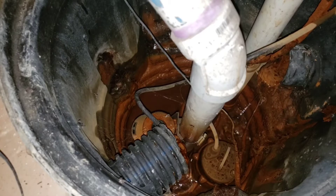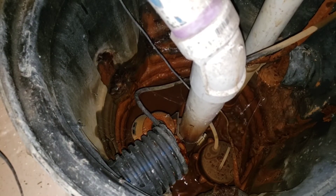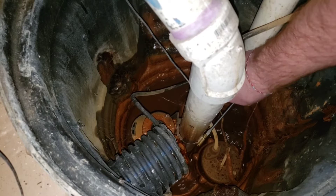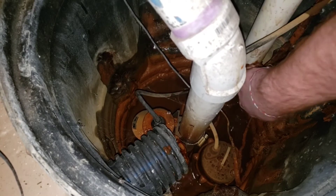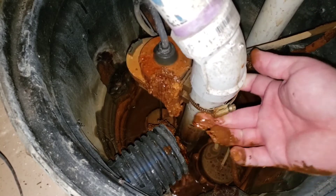This piece goes in with a little pin right there, and then I just need a flathead to open that up. Now I'm going to disassemble the old one inside and show you what that looks like. Inside here is my other connection — that's what I need to loosen up. First I want to make sure I unplug everything. Sump pump unplugged, switch is now unplugged. Then I'll get my flathead in there and start loosening this up — this is not a clean job, so notice right away how dirty everything gets.